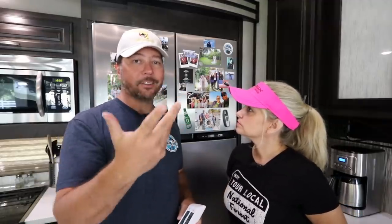That's important. We see so many people online say, well, I kept it closed, my food feels cold, everything feels fine. Guess what? Your hands aren't very good temperature sensors. And if you've got chicken or meat in there, food safety is important. 40 degrees to 140 degrees is what the USDA calls the danger zone. Anything in that range can grow bacteria very quickly.